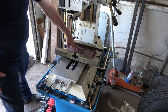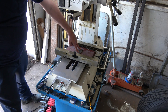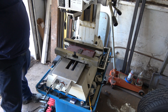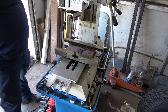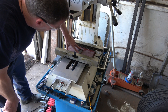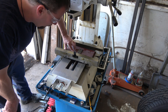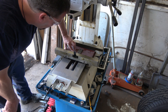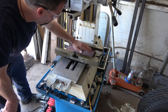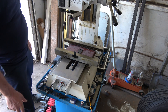These two screws that hold the axis ball screw mount are directly over top of this ball screw, so that could really be a pain in the ass. It's going to have to be that way though, because there are two bosses on the bottom of this casting that give it a little extra thickness where you're bolting it up to, and I think I'd rather stay there. So I'll actually have to assemble the X-axis and move the table over so I can get this bolt back in it for the Y-axis. Man, that's not fun.